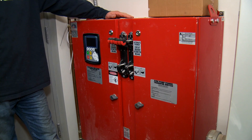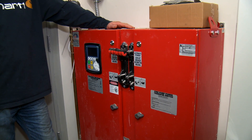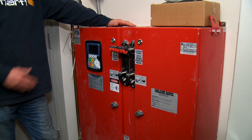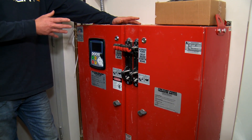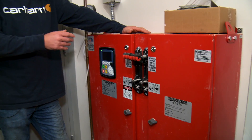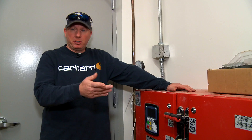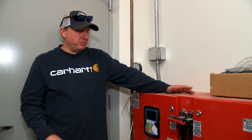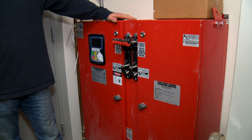This is the control panel for the fire pump. When you have a problem throughout the building, the first thing you do is shut the fire pump off, because if it engages you have too much pressure going through the lines. So you shut the fire pump off first, then the jockey pump, close your valve, drain your system, and once you get pressure back on your system, this is the last thing you turn back on.